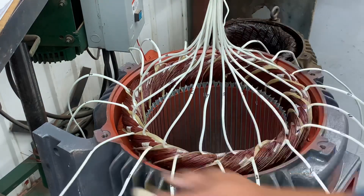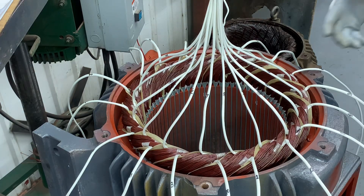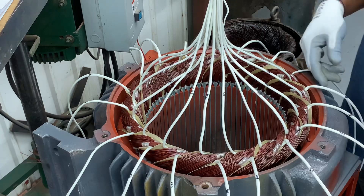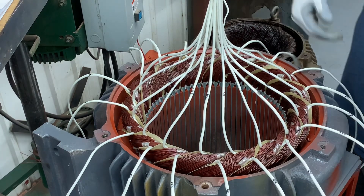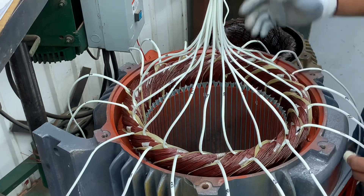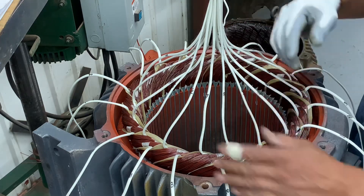Then start again: 1 — 4. Yeah, that's a simple connection of motors. Just remember: 1, 12, 2, 10, 3, 11. If it is 6 leads: 1, 6, 2, 4, 3, 5 — 1, 6, 2, 4, 3, 5 — and it's all the same like that.